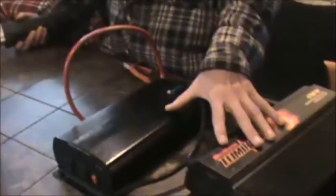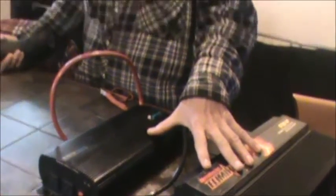Another crazy ghost load: the older infrared motion-sensing lights — the type where you'd turn it on for a second or two, turn it off, then turn it back on and it would stay on. Those were fairly popular in the 70s, 80s, and 90s — I bet that draws close to 28 watts just to give you that function. You're better off having a 13 watt compact fluorescent wired in with no switch and just leaving it on — it would be a lot cheaper.